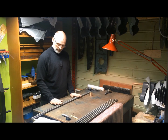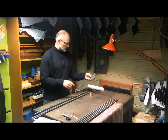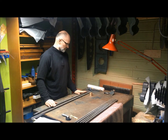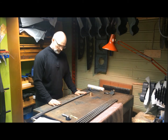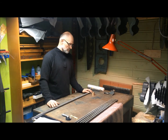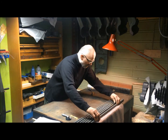The ELS2 is now commercially available. It means you can do away with the change gears, and also with the tumbler mechanism — this could be left in place, but there's no need for it. With a controller, you can synchronize the spindle speed with the help of a tachometer — a sensor to measure the RPM — and then feed this to a stepper motor to control the longitudinal feed. Very nice way to avoid the change gears and also swapping between feed and threading. You can also retain the use of the 8 TPI imperial feed screw with this system, but I want to try both metric and imperial.